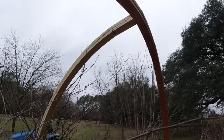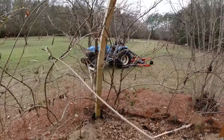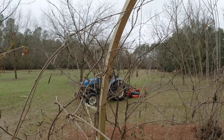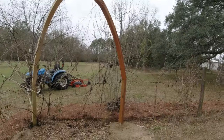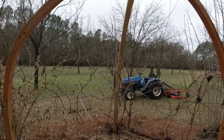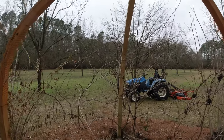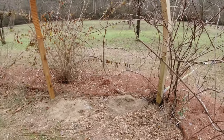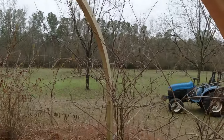There we have the second arch complete, connected to the first one we did a couple weeks ago. That went really well. I like that plywood frame to clamp everything to — it made for a nice smooth arch. I actually got no splits this time, whereas the other one I ended up getting some splits. Now I've got to put some wire — maybe two rows — to give the wisteria something to grab onto and make it more of a dome shape. Then I'm going to stain it to match, put some clear coat on it, and be done. I appreciate you guys sticking around, and hopefully this helps you out in your steam bending project now that you have two videos to watch.